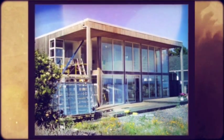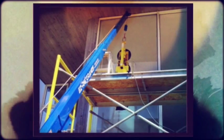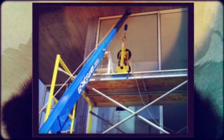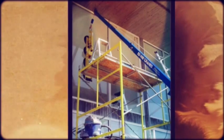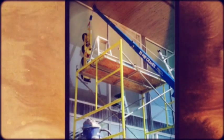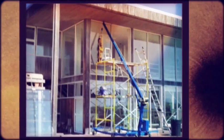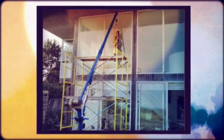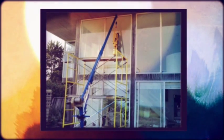What's more, Alan said, I was able to easily maneuver the crane and suction lifter under load to place the upper windows and the skylights. I rolled the crane with the load, lifted the glass to exactly the height I needed, rotated the pane into place, then made adjustments as small as one quarter to one half inch with the up and down switch. With the panes already in the hole, Alan was able to insert one eighth inch adjustment blocks to get square alignment. Some of the windows were 36 by 102 inches, but most were 4 feet by 10 feet.